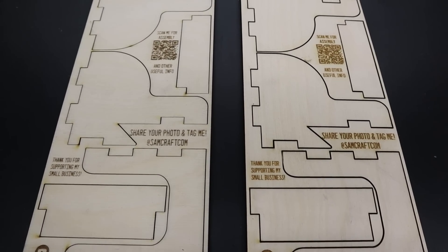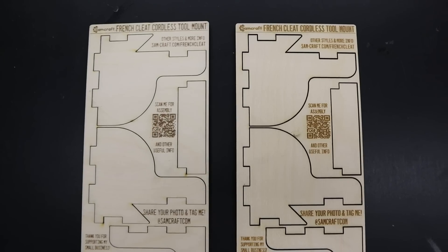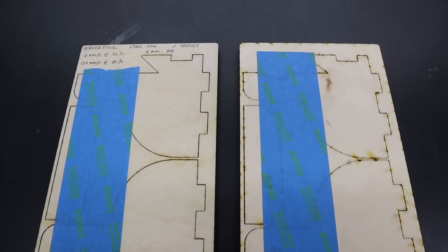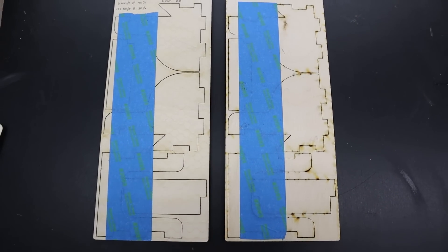One thing to note: look at the quality and thickness of the cut line for the X tool versus the CO2. There is a stark difference in quality and visual appearance right out of the laser. If diode lasers get powerful enough and reach CO2-level speeds, CO2 lasers may have met their match. The engravings from the diode are crisper, the lines are thinner, and there's less charring and less cleanup after the fact. However, time being money, the CO2 is faster, so that's what I run for all my cut jobs. But if diodes get there, CO2s are done for.